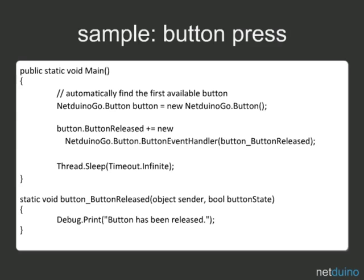With typical microcontrollers, you have what's called a control loop, and you just go around in a loop over and over again, analyzing variables of data that's coming in, and then taking that information and doing something with it. So you say, have I moved as a robot? Yes. Okay, where have I moved to? Now let me take that information and act on it to keep myself on course. But as your project gets more and more sophisticated, as control loops get more and more heinous and it becomes harder to weed out bugs and all this kind of stuff.